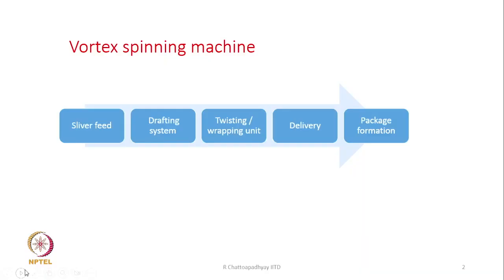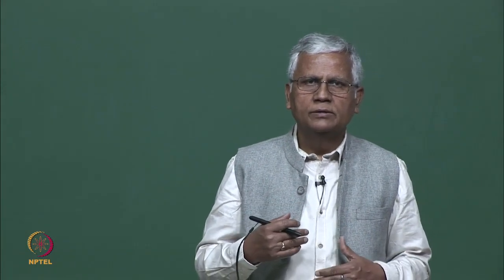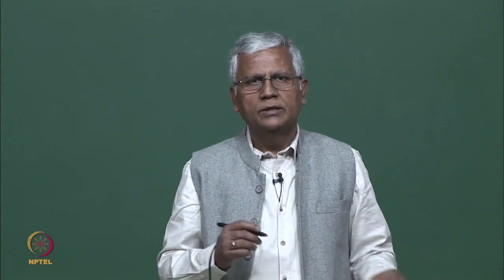So, today we are going to discuss vortex spinning. In the vortex spinning machines, what we have is a sliver feed system, which is generally a can, and this will be followed by a drafting system. And then we have a twisting, or you can say wrapping unit, followed by this unit we have a delivery, because by the time we have formed the yarn through twisting and wrapping actions, the yarn has to be delivered.